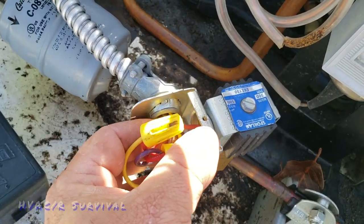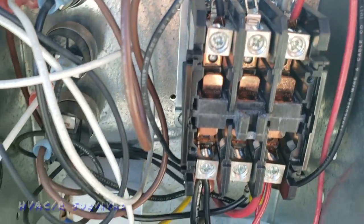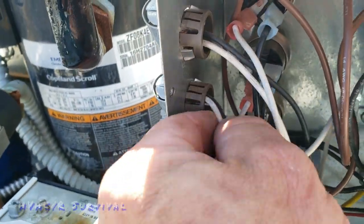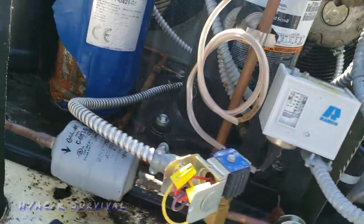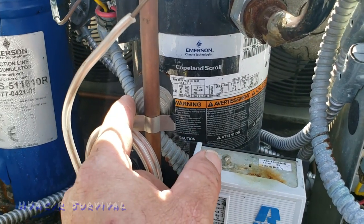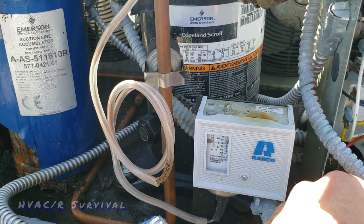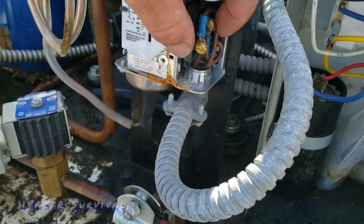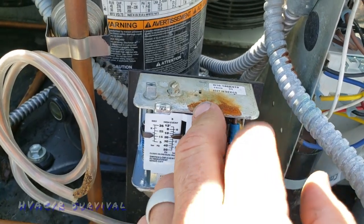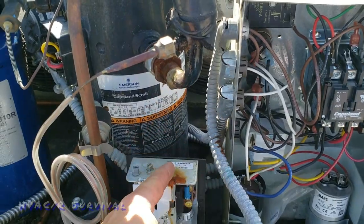Checked the solenoid - no pits or cuts, contacts are free, no burn marks, everything's tight. Don't see any cuts or nicks in the wires. The lights are on a 15-amp breaker, so if that had anything to do with it, that would shut it down. I have had hot gas sensors rapid-cycle contacts and create problems in the past - I don't see anything loose or unusual in this area.